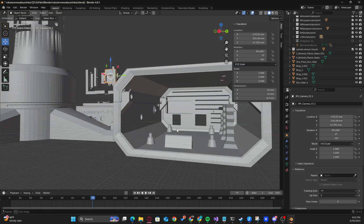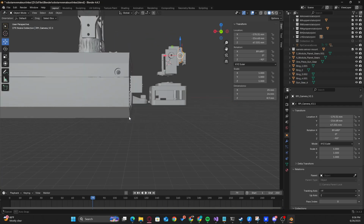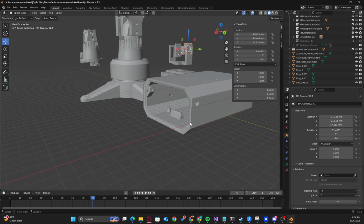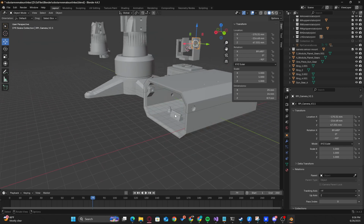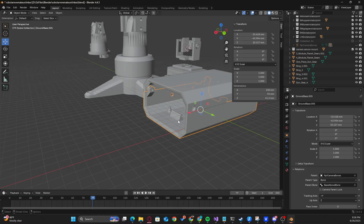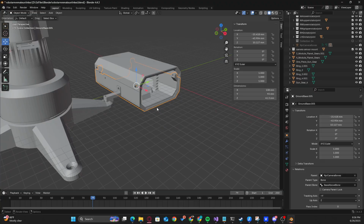For this, it's pretty straightforward. You just get the Arduino Mega, put the RAMPS hat on, and then put it in here. It should just click in because there's a way to click the board in from there. This little area, there are little places to put the screws too.